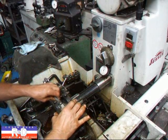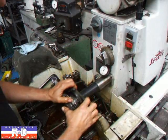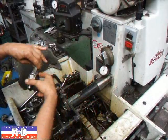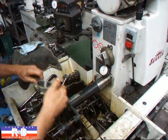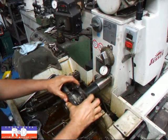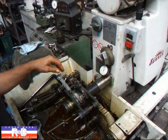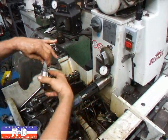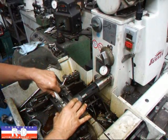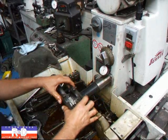Okay, we're right on size. As you can see, every time I put the rod in here I flip it over. It takes any taper that might come into the rod — it's not that that happens very often. All right, we're about one and a half tenths over. Take it out just a little bit more, so when this thing cools down it'll be right on the minimum.